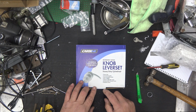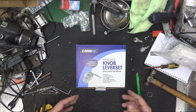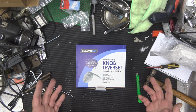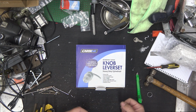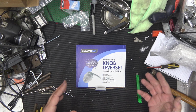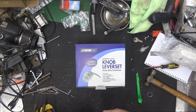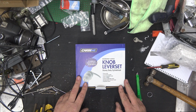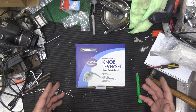We do use a few of these, and the reason being is because they're really good for fire doors. They're fire rated, they come with a 70mm standard latch, and they've got the lever on the inside, so that complies. And also they've got the PD cylinder on the outside, so that's good for all types of keying, whether you're just keying alike or you're putting in a security key, anything like that. So the lock's compatible with the most common cylinder.